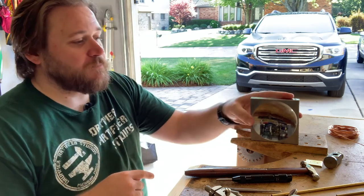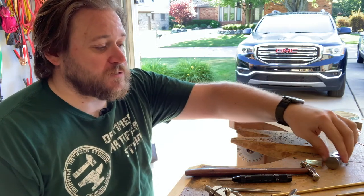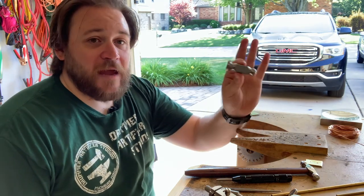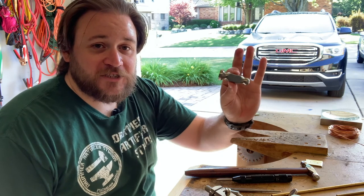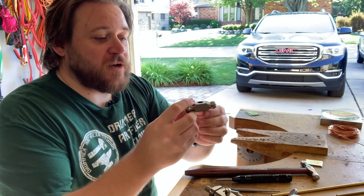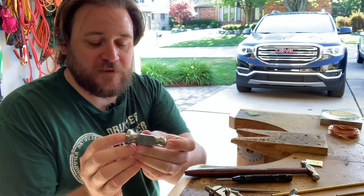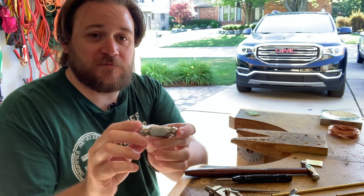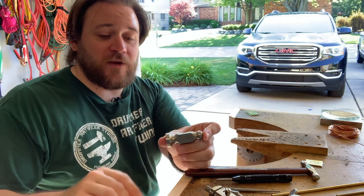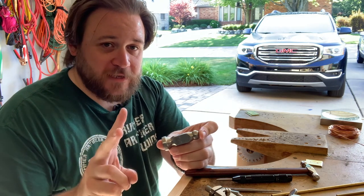The other thing that I use a lot for rivets is simply a hammerhead that is not attached to a handle anymore. It can still be on the handle, but this makes it easier for you to use. This one I like using because it's a chasing hammer, is the technical term for this. It's for a different process that I'll probably make a video for in a while. But what's important about it is that it has two heads on it.